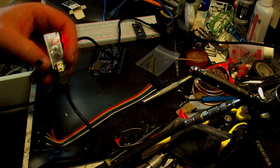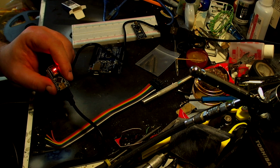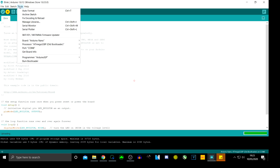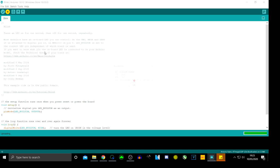Okay. Now I know this works because it worked earlier for me. That's all plugged in, yeah, and it's on the correct port. Because that's one of the other important things. Let me bring you back here. You have to make sure that you're under Tools. It's showing the correct Arduinos that it's needing to use. So unknown board, upload any sketch to it. But as you can see, for some reason it's failing to upload it, so it may need to have a bootloader put on. Okay, so let's come out of there